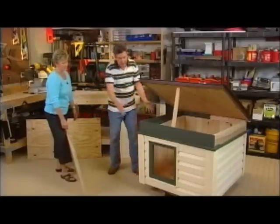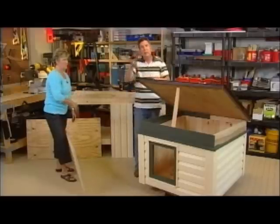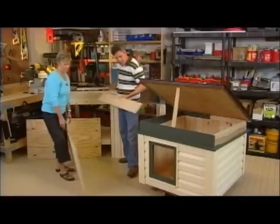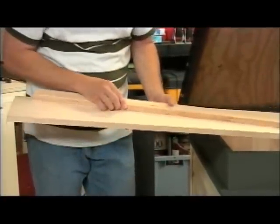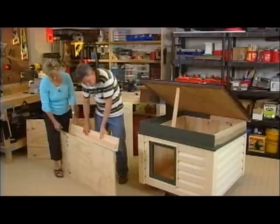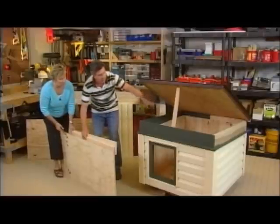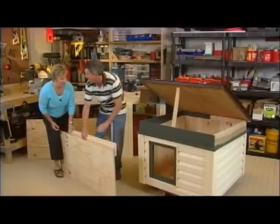The next step after you build your box is that you need to have your roofing system started. You need to have this pitch — it allows the roof to drain off any rain or snow. The higher the pitch, the better, but I went with about a four-degree pitch and that's plenty. This is the fascia board outside — a one-by-six board. I found my pitch and laid it on the marking so I can add this cleat. Once attached to the board, this cleat rests on the box so that you get that pitch angle. This is where your roof line will be, and you can see how it's pitched down. You attach the board from the outside, the cleat rests on there, and that's how you do the pitch.